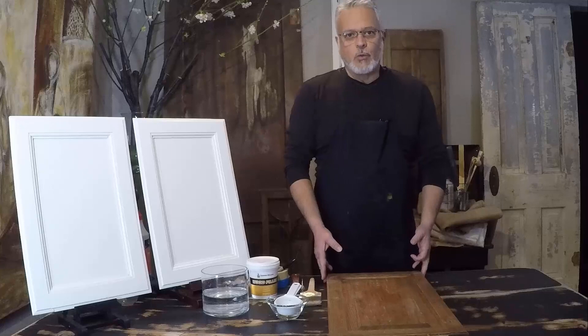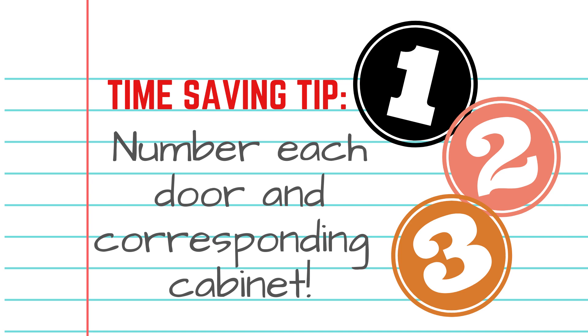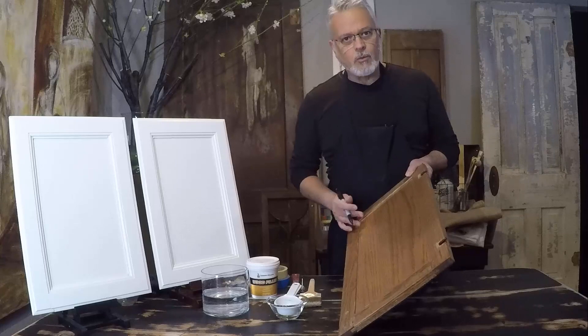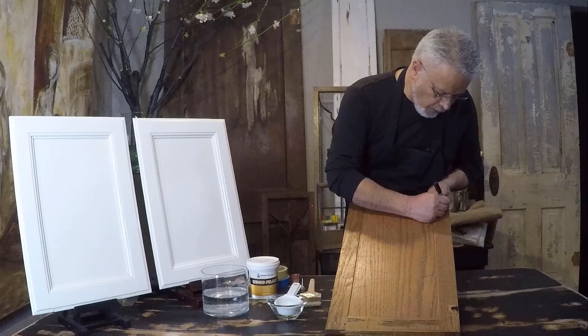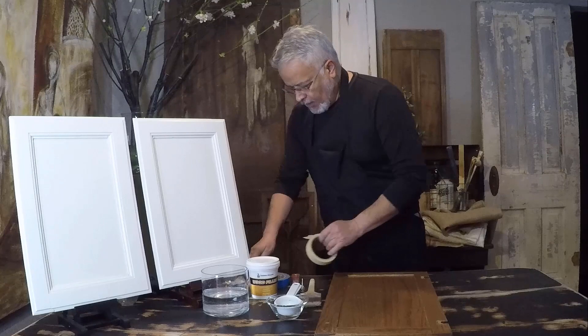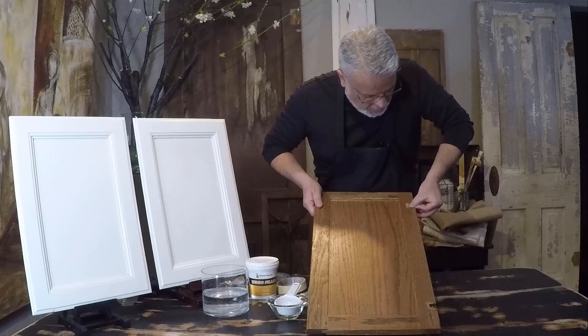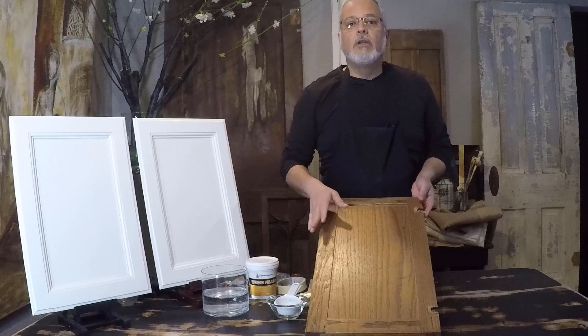The first thing we do is remove the doors from the cabinets. Make sure you number them — the door and the cabinet where they go back. The way I number these doors is with a marker and I use a piece of tape too. In this case the doors have a little notch where the hinge fits and I can go straight into the notch and write the number. I put number one right there and then take a little piece of tape and cover and put it on top of that number. The reason I do that is because when you paint this door it will cover everything and if I don't tape it the number will be gone.